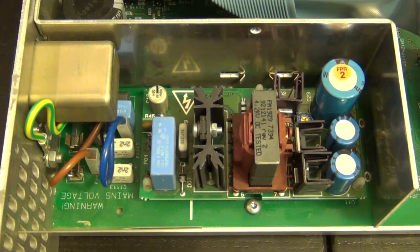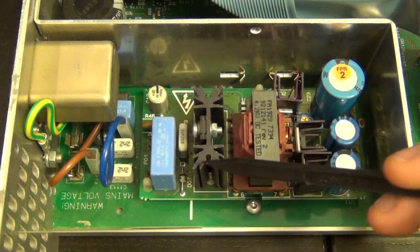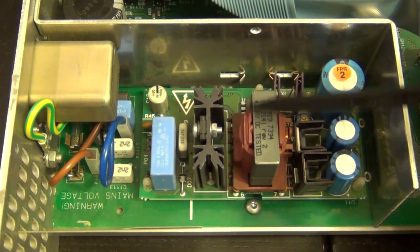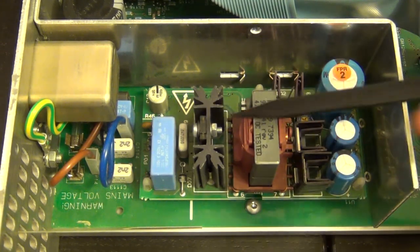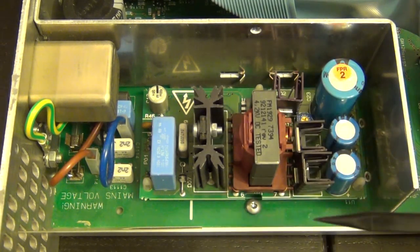That makes sense because you need that. You can't get away without it. And be very careful with these heatsinks, especially this one. Most likely this is live, because I don't see any disconnection, I don't see any protection there to insulate it from there. But you got to be very, very careful. We'll measure it, but I'm fairly sure this will be live. So be very, very careful.